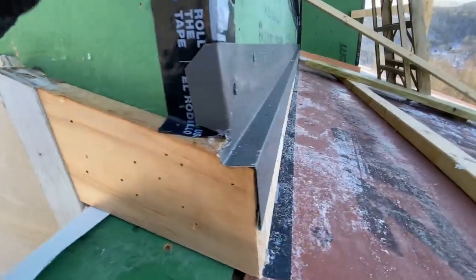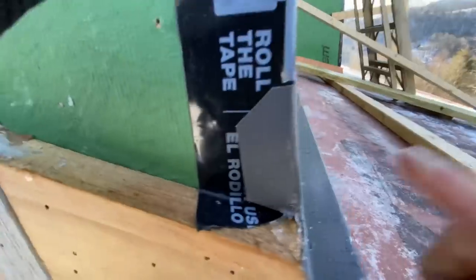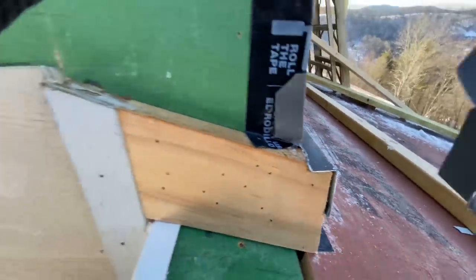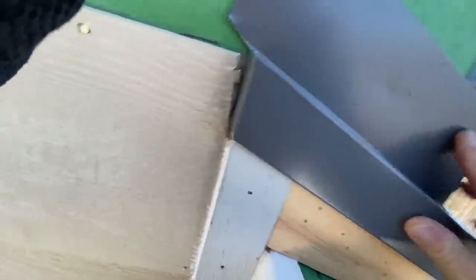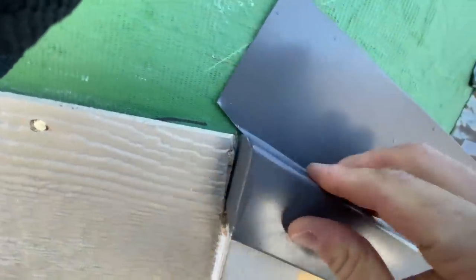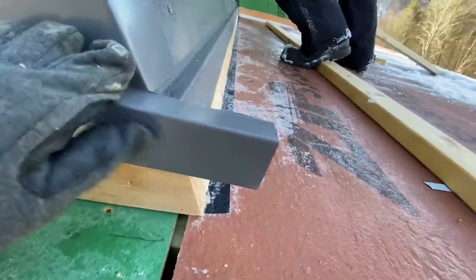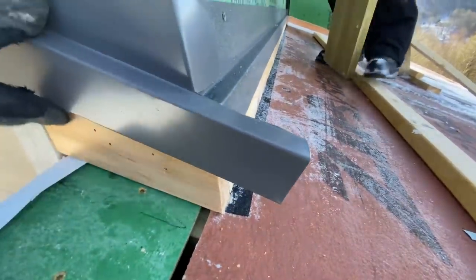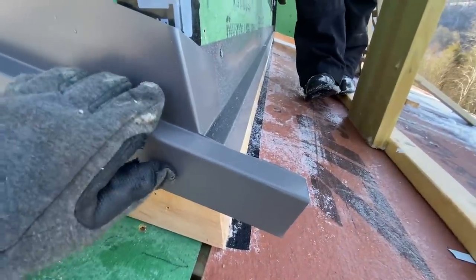From this outside corner there's my straight run. I have it notched and wrapped around the corner up here but not down here because Uncle Larry said don't do that. I have this piece made with a little end cap to go up here, and I chiseled out the siding to let that get back in there. It's wrapped on the corner board because a corner board is getting nailed on. Down here this is going to run long and Larry is going to cut and fold this over later on — you actually need to be able to slide metal in from underneath and up behind this, so that's why this is open-ended.